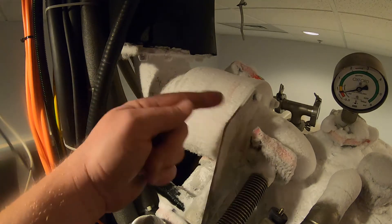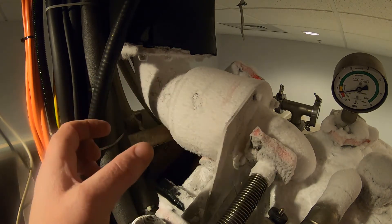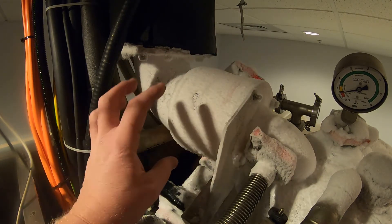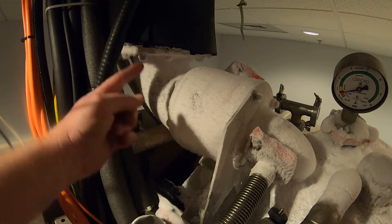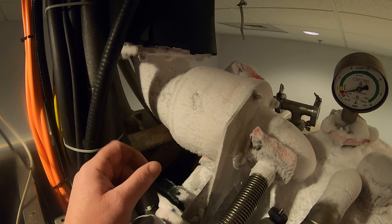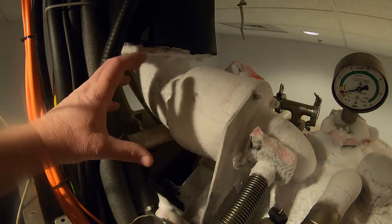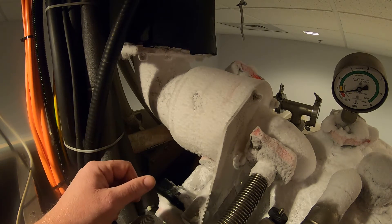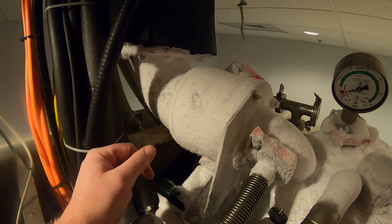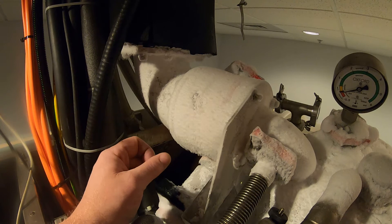The burst disc is in there, so we have to take this elbow and burst disc assembly out as one. You can't just unbolt it from here and slide it out, because these bolts are threaded into the burst disc assembly itself. We have to take all of these off — it's going to be a nightmare. I'm going to try not to give myself a cryogen burn, then we'll take the four nuts off and pull it out as an assembly. I'll probably do a time warp on this to make it quicker, but here we go.